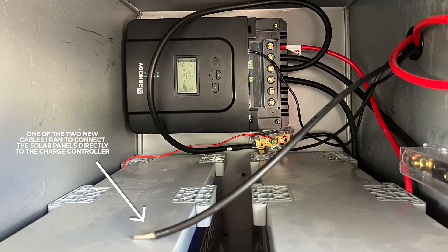Unfortunately, that's not how it worked. Those cables didn't come out at the batteries — they went somewhere else in the trailer. I found their charging connections combined with other charging connections the trailer already has. That meant I wasn't able to increase the voltage drastically through that cable because I didn't know where else it went. It seems those cables end up connecting somewhere with the connection that comes from the towing vehicle, allowing the alternator to charge the trailer. After figuring that out, I realized the easiest thing was to run new cables from here all the way to the battery bay.